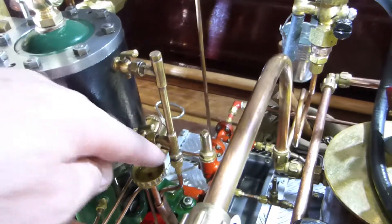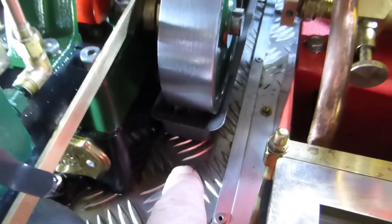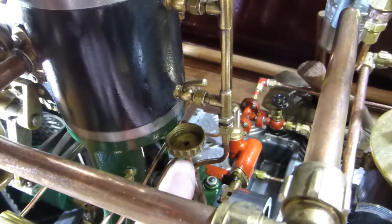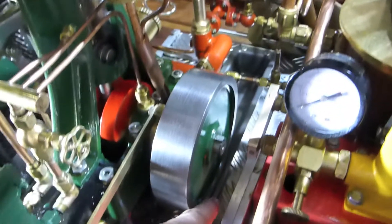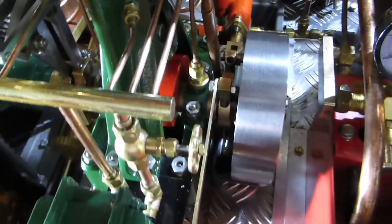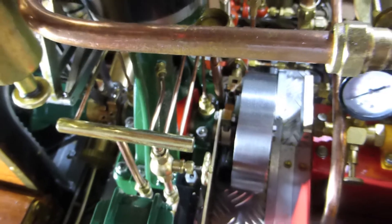The drain and condensed water goes through the pipes down into a sink. I also have a drop catcher which collects dripping water and guides it into this tank. This prevents dripping from falling onto the gear and washing away the oil, which would be harmful to lubrication.